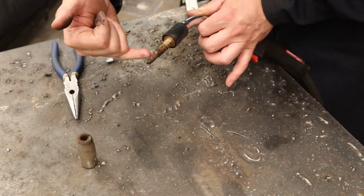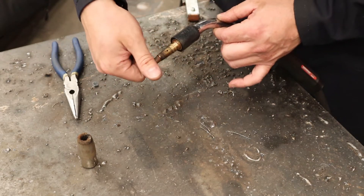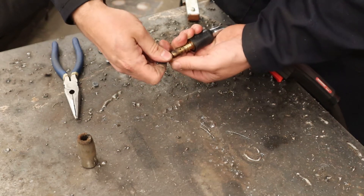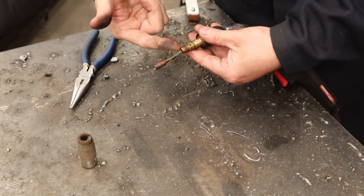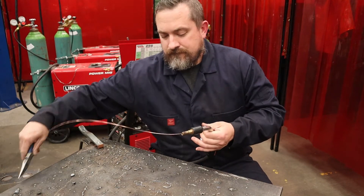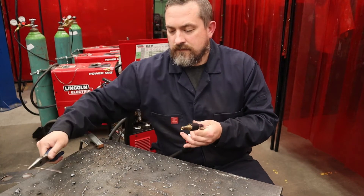Because the wire is welded to the contact tip, when you try to unscrew it, it springs back — you're winding the wire up inside the liner. That's okay, just keep going. After a couple of turns the contact tip will come free, and then the next step is to pull the entire wire right out from the whole liner.